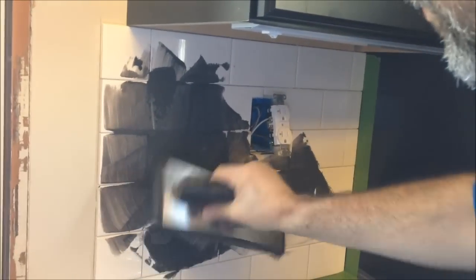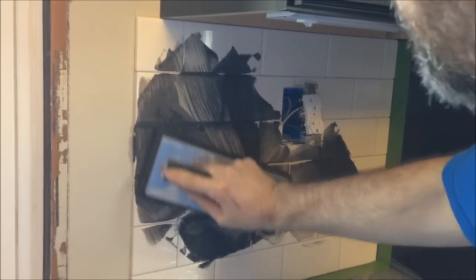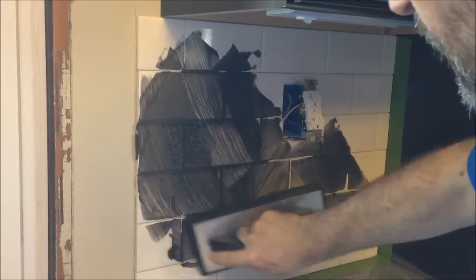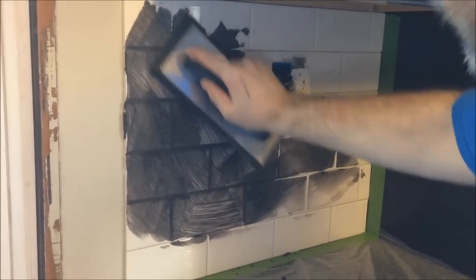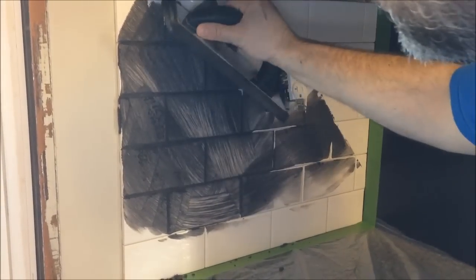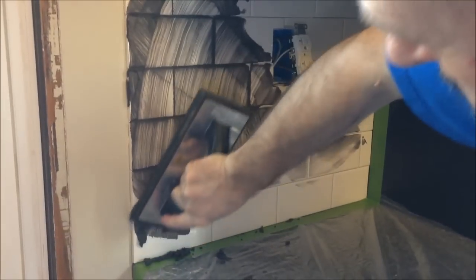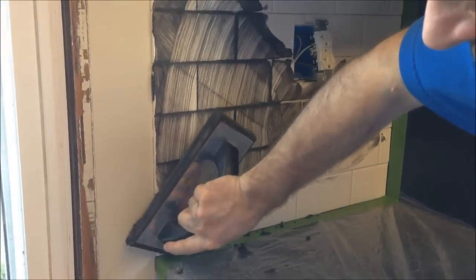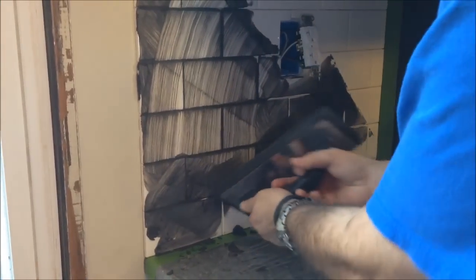This is the grouting that you don't see on TV. And it makes a horrible mess, and you have to put it in between each of the lines, and then you have to wipe it off. So, do you have to immediately wipe it off? You take this and squeeze it off. And you go at an angle, so you won't pull everything out of the slot.